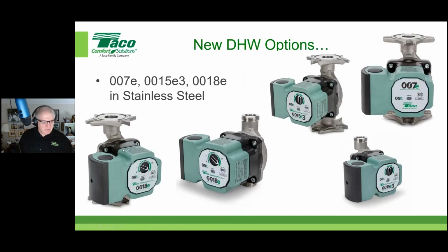And lastly, I would like to share with you some new DHW options we have just come out with over the course of the last couple of months, and they should be getting out into the marketplace anytime now. These are our other ECM solutions, the 007E, 0015E3, and the 0018E, all available in stainless steel volutes now for domestic hot water recirculation options. They come in both flanged with our four-way universal flange, as well as union connection. So you can get them either way for stainless steel applications.